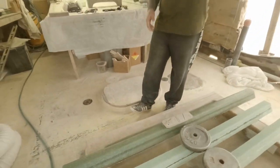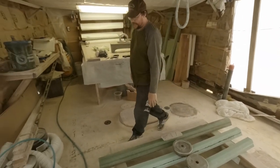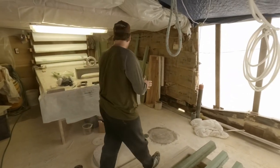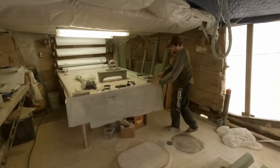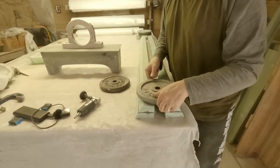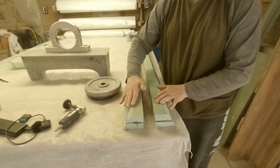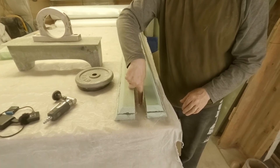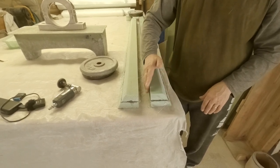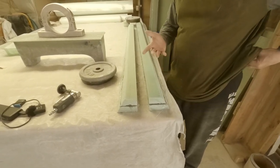And you can see the amount of strength in that already. Yeah, that's pretty impressive. So we're going to have a set of two on each side. They'll be spaced about like these two are right here, and in the same configuration, leaving a slot in the middle. Then we'll laminate up and over, down in, against the bulkhead, back up and down, and so they'll get several layers. They'll probably come in this way with the layer, that way with the layer, and then get this U shape with a layer. Well, several layers.